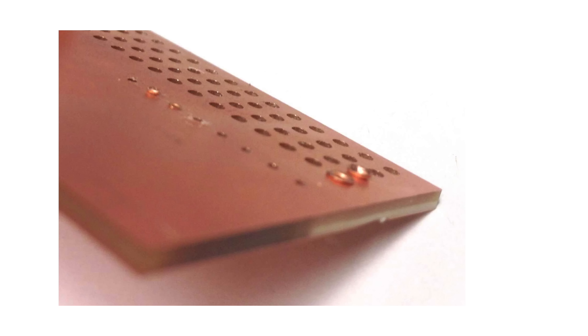You can squish them, and I think you could get a really thick solder mask layer that kind of makes up for the height difference, but you're still moving your part further away from the copper, so I think it'd have to be a really thin rivet. I'm going to explore all this and see what's the most viable, but I have a feeling the rivets are probably the best.